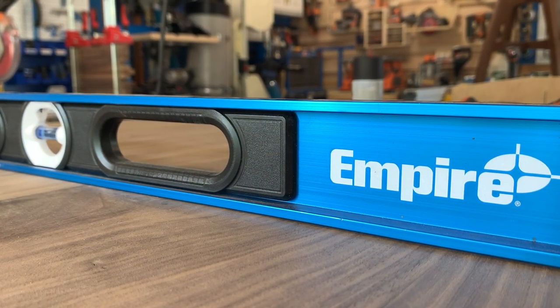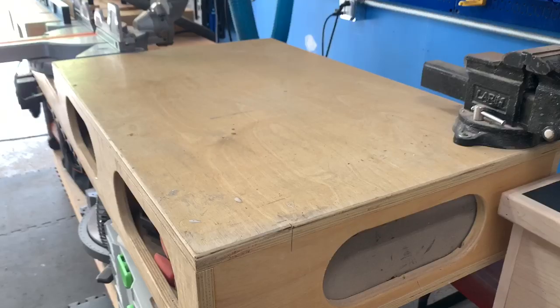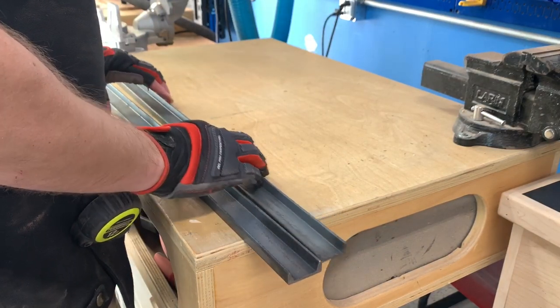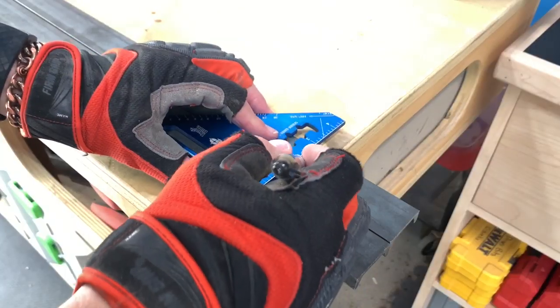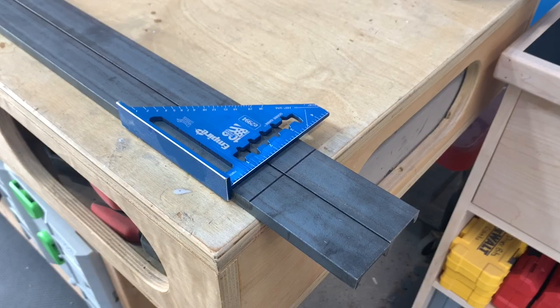One other thing that bugged me was that we had a ton of heat and humidity after I'd finished the tabletop, and it developed a slight buckle towards the middle. I've always liked how they use steel C-channel in larger slab projects to stabilize them and keep them as flat as possible, so I incorporated the same idea into my tabletop.